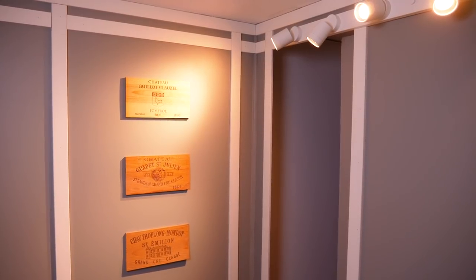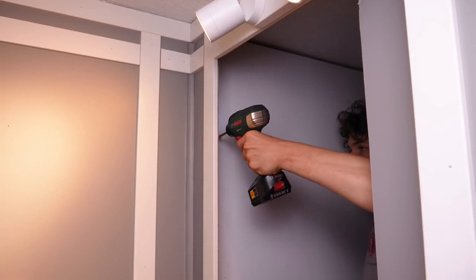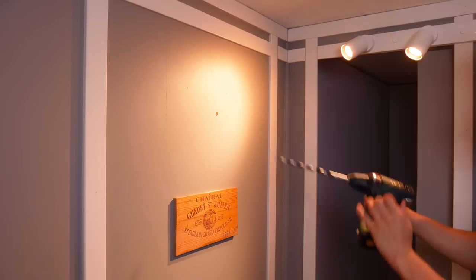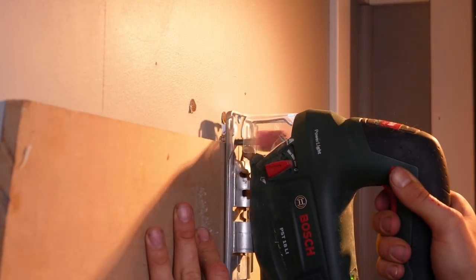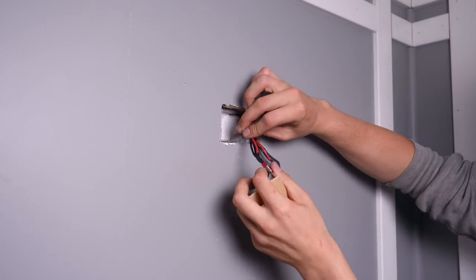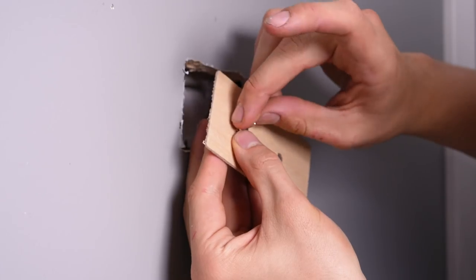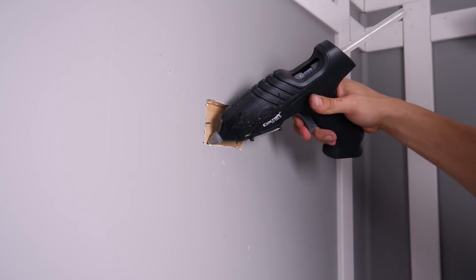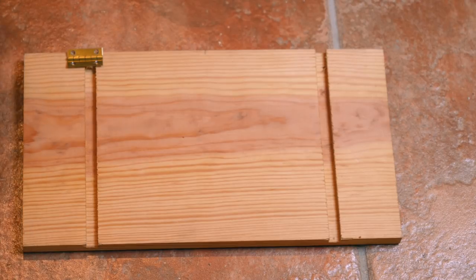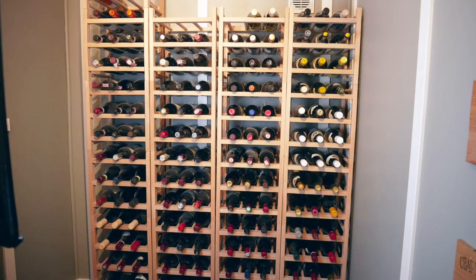The trigger mechanism is going to be hidden behind one of the wine box plates that decorates the wall. I decided to run the cables behind the wall rather than behind the baseboard, as it seemed a lot more practical. I drilled a hole in the wall of the hidden room and used a jigsaw to create a square on the front wall. I soldered the three position switch to three long wires and pushed them from one hole to the other. I fastened the switches on a thin piece of wood and hot glued it in place just in case I ever need to take it out again. The wine box plate will be attached using some hinges so it can be lifted up and down to access the control panel. I also have a similar set of switches on the other side of the door so that it can be opened and closed from the inside, which I think is really important for a secret door.